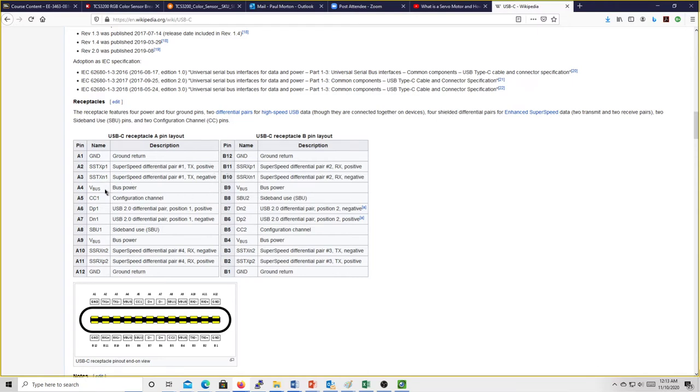Looking at the wires involved in USB-C: there's a ground, super speed differential pairs, bus power, a configuration channel where messages are transmitted back and forth, USB 2.0 differential pairs, sideband use lines, and additional ground returns. It's a 24-pin double-sided connector — a little bigger than the micro connectors. It looks a bit like the Apple Lightning plug. The cable itself has four shielded pairs plus a couple of unshielded twisted pairs. Some of the conductors are pretty good size because USB-C can go up to 40 gigabits per second — very fast.